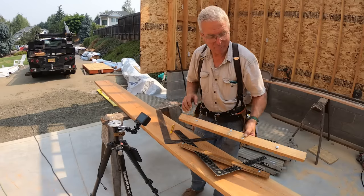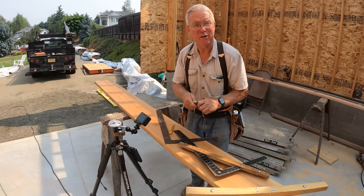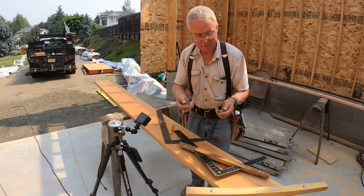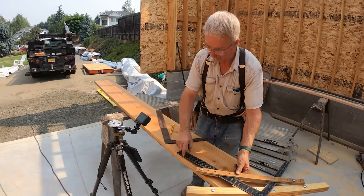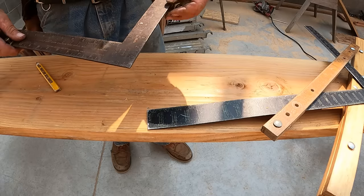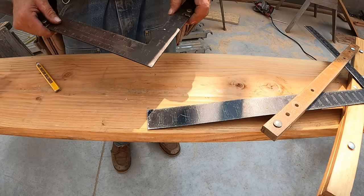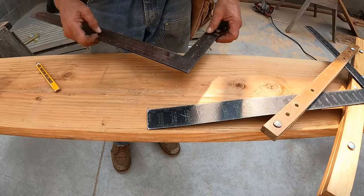Now, for most of my adult life, I believed and assumed and couldn't imagine that stair gauge sets wouldn't be the best solution. A stair gauge set slips over the tongue and the body of a framing square, a steel square, and then you can slide it up and down and tighten it up at the point.